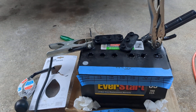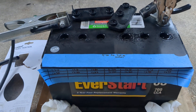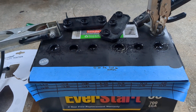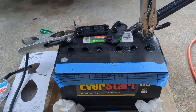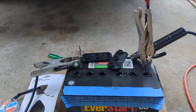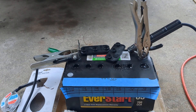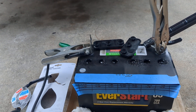I am trying to rejuvenate this battery here, as I've seen done on YouTube by guys like Uncle Tony's Garage. Make sure you have this in a ventilated area — I have a fan behind me blowing it away from me. These bubbles are giving off gas that is actually flammable, so don't smoke around them.